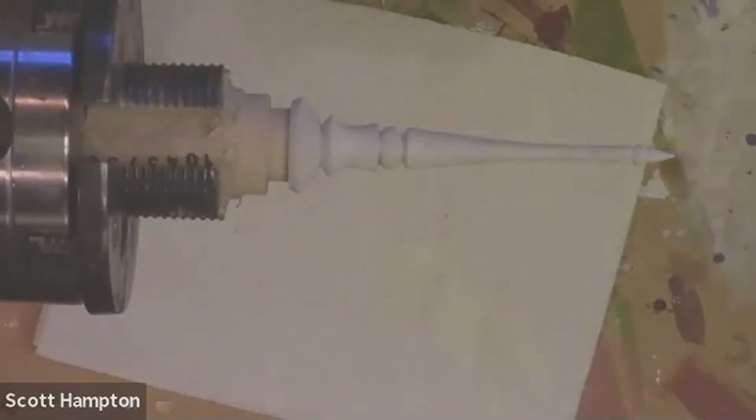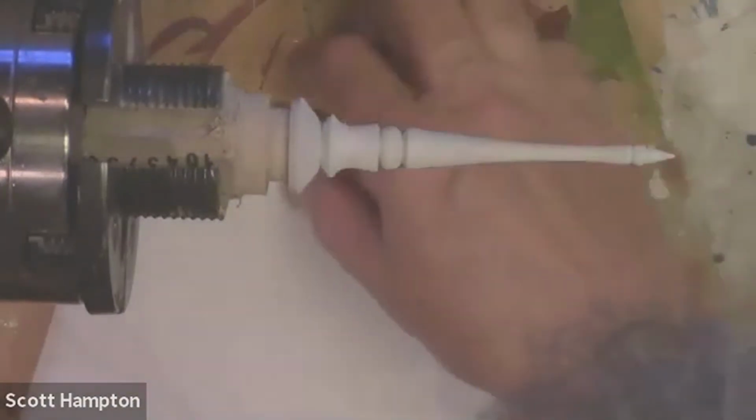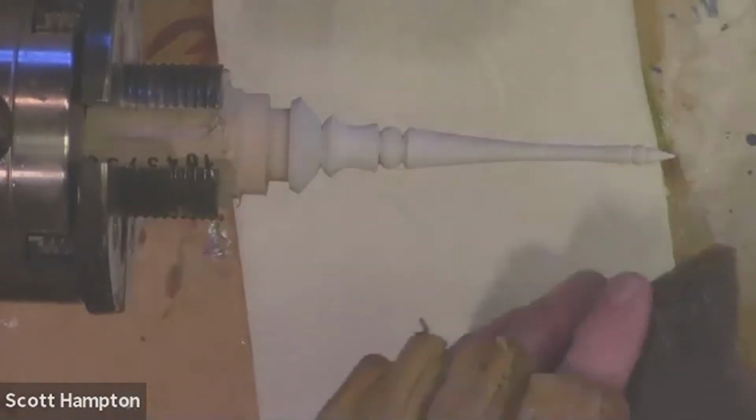That should have done it. Nice and dry. So I'm going to get that Scotch pad again. I use the gray ones. Don't use green, because the green dye will actually come off onto the wood. So I usually use the gray, the color that usually doesn't come off, or the white ones are really nice for this.